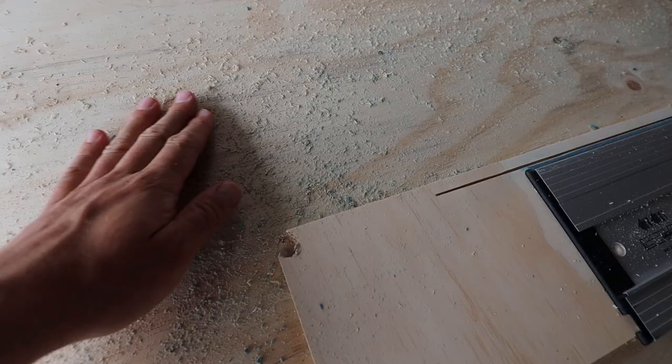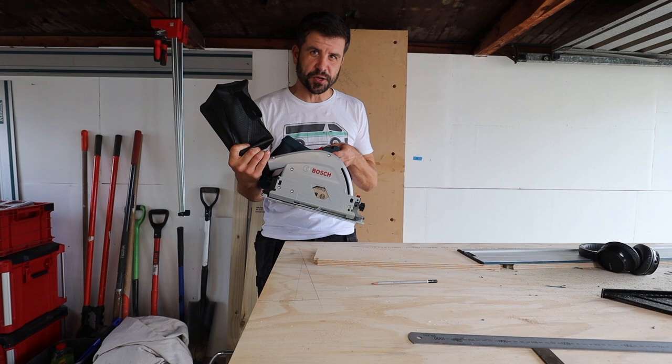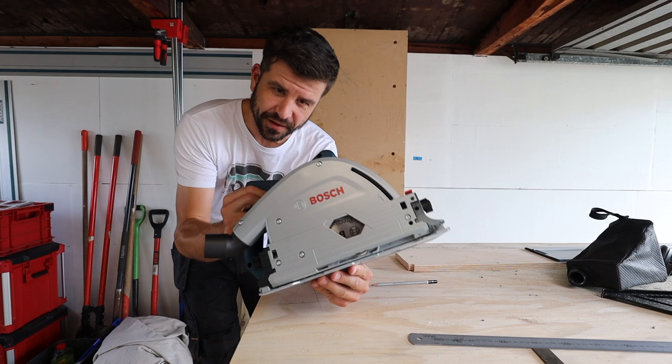There's one cut with just the dust bag — that's great for quickly trimming a door or something, but don't expect good dust extraction. I'm a big fan of dust extraction on most tools, and that started with the track saw for me. You pretty much have to use dust extraction with a track saw — it's designed that way, with the dust guards all enclosed, giving the dust one point to exit.